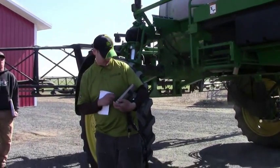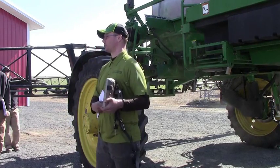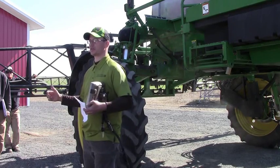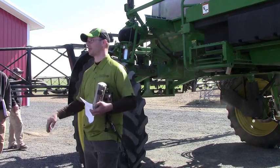Last thing — if you don't have your auto boom sensors on these self-propelled sprayers, there is also a boom return to height you can calibrate. What you do is calibrate all the way in the low position, all the way in the high position, and then set it to wherever you want to spray, say 36 inches. Once you calibrate that, you can just go ahead and hit down on your main boom on your hydro handle, and it'll lower it to that 36 inches and stop. To get it to continue past there, you'll hit it again. So you can actually set that set point to where you want to spray without the auto boom sensors, instead of having to look back there. Just push down your hydro handle and it'll remember that 36-inch spray height.